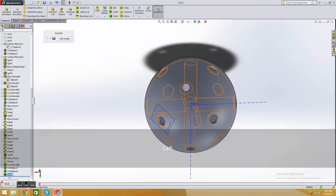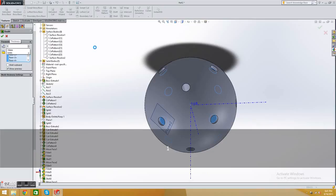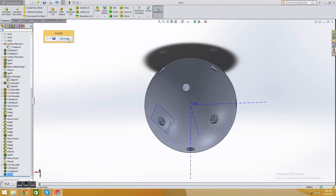Oh, if you notice the shells, edit this. Usually you want to make the core a little thicker, so the core arms are tough. Let's make it like 1.2. Oh, make it 1. Because you want the core arms to be thick, because there's screws going into those. You don't want them to crack, which has happened. I usually make my core a little thicker.